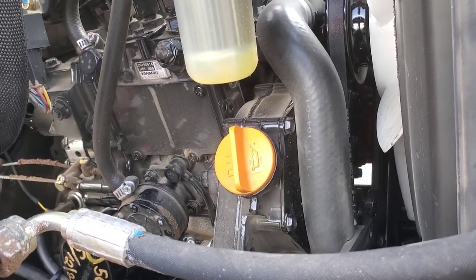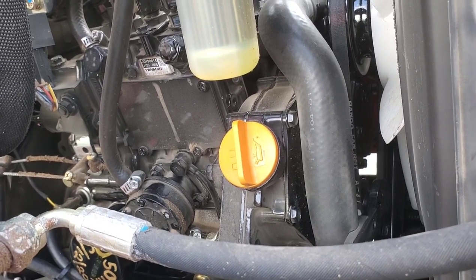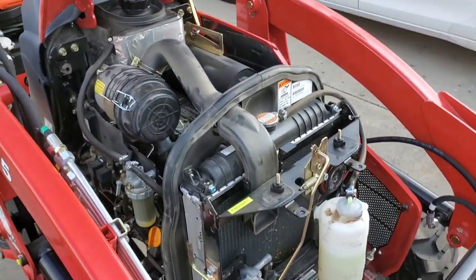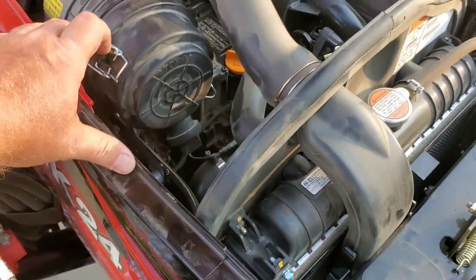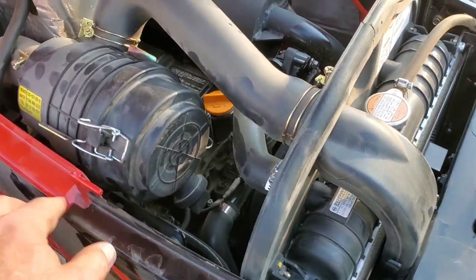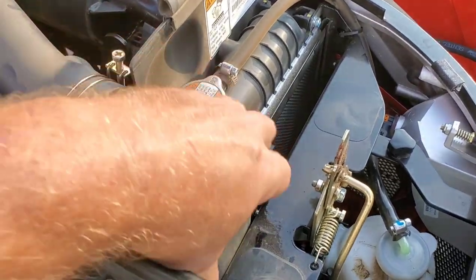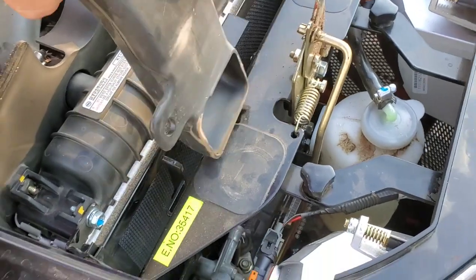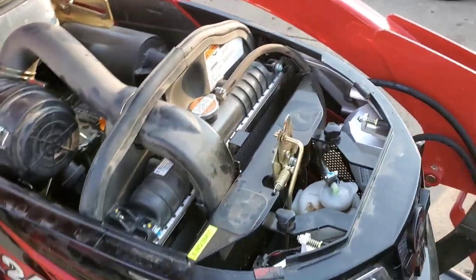The only problems we've run into were on the hydrostatic part — with the filter being located the way that it was, as well as that sump screen breaking apart when reinstalling it. But everything else was not too bad at all to service. Now with everything back together, it's all screwed back together and tight. You can see there is still plenty of room to access the air filter whenever you need to without taking off the side panels. As well as this front screen — you can pop that up and just slide it up whenever you need to blow that out, and it all just snaps back into place real easy. Doesn't take but a couple minutes.